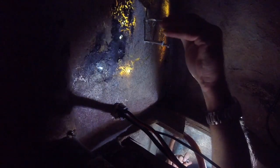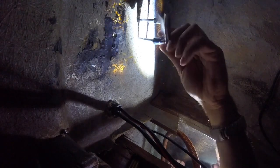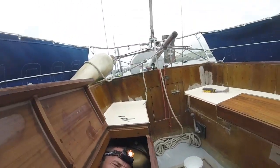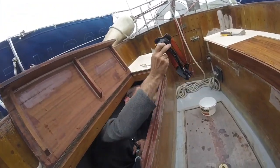Of course the deck in this area is solid fibreglass — only about half an inch thick — so I'm not going to use a backing plate on this, because as you'll see in a minute I've already fiberglassed an upstand into the deck. The chances of this tearing through the deck — it's not going to happen. Four stainless steel coach screws are enough to persuade it to just stay there. Excellent. Done.